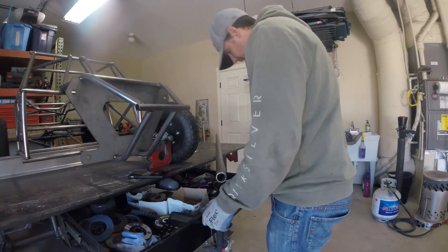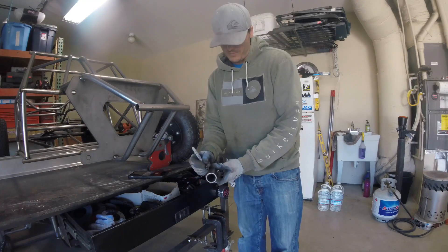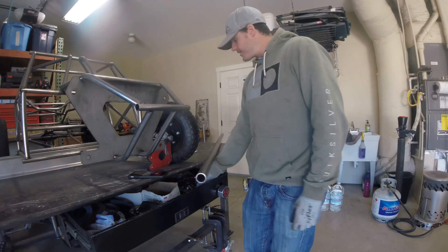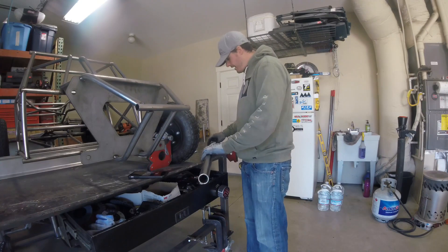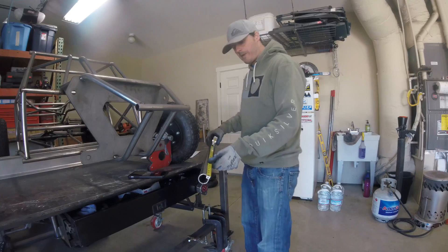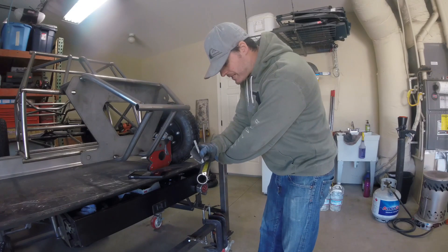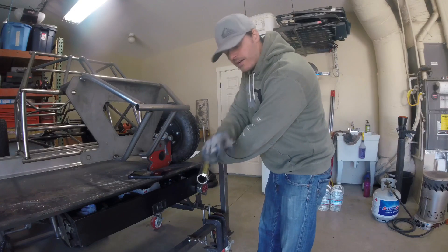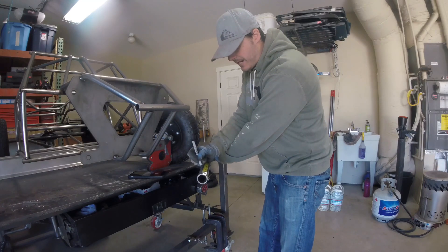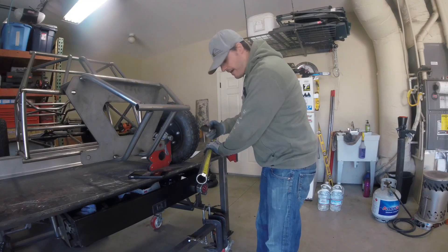When you start getting into more complex bends, I like to mark the start of the tube with an 'S' — this is the start side, the other end is the end side. From the start side I'll mark according to my bend recipe. I've got a cut-off start, so I'll mark five inches and note 'cut' — that's extra material I'll cut off. Then I start marking my bends: 7 and 13/16ths...